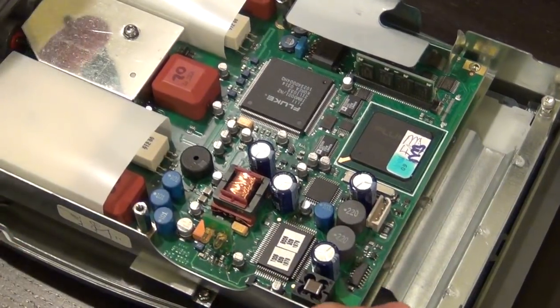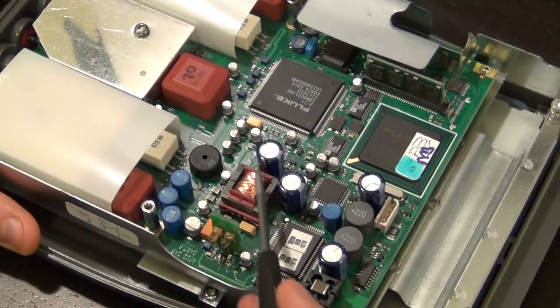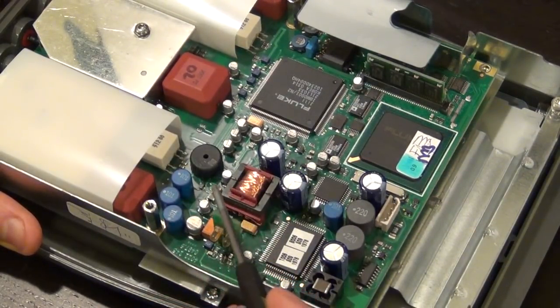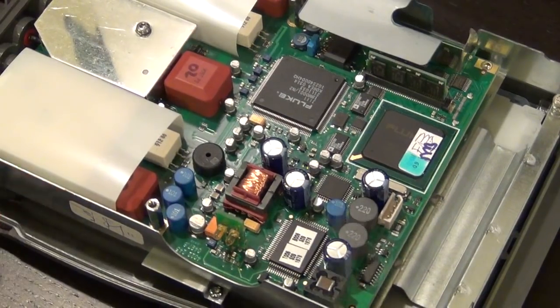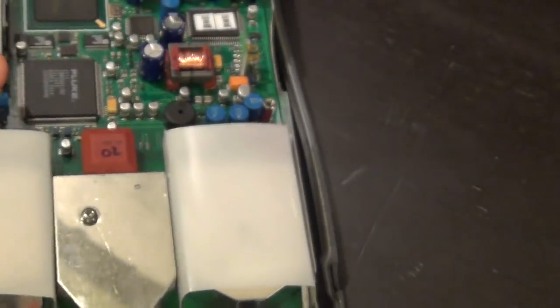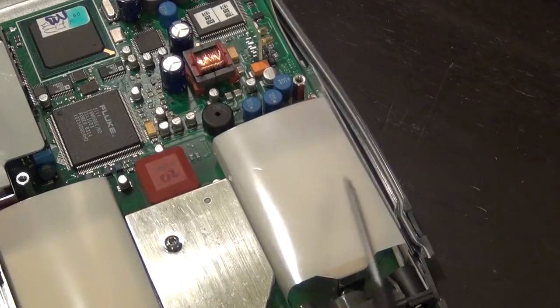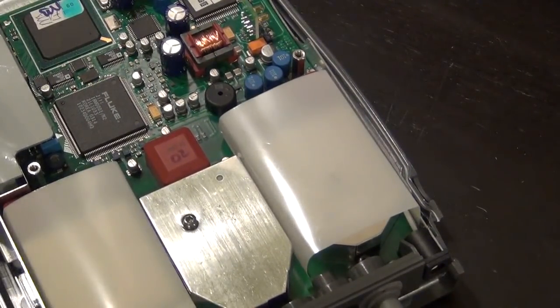I can see, let me see, there's of course a couple of capacitors in there. This looks to be the charging circuitry, which will charge of course the battery. The adapter plug is right here, and it looks like it has some cables that run across and end right here. It's a little bit surprising to me, because these cables are running right next to the analog channel. Now I'm sure that they have taken good care to shield that, but if your power supply is noisy, I wonder if it would couple into this channel right here.